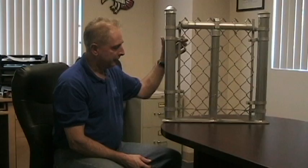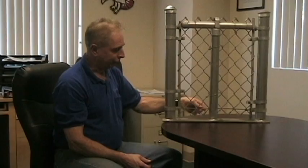The chain link is a little bit elastic and springy, and you usually don't want the bottom of your fence springing around too much. So the tension wire, attached with these little rings called hog rings, will help maintain the bottom of the fence so that it doesn't spring around and a dog can't push under the fence as easily as it potentially could without anything on it.